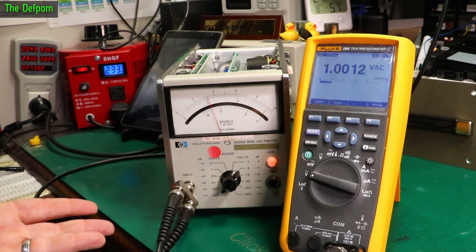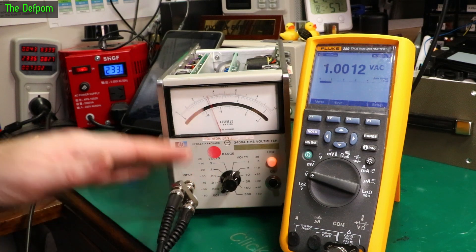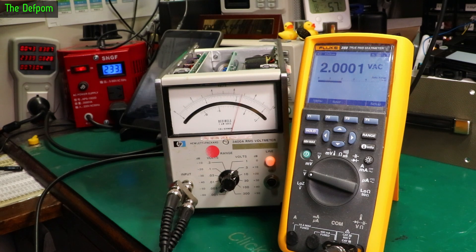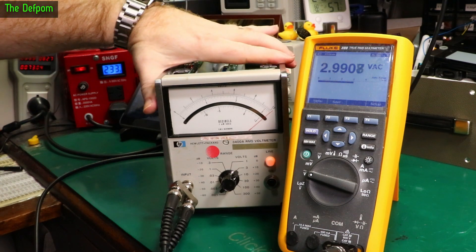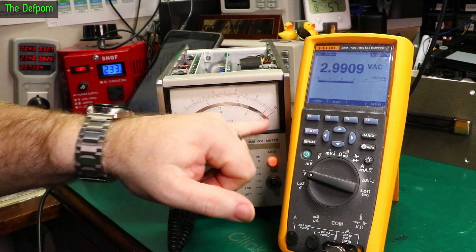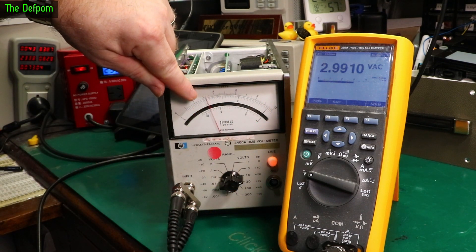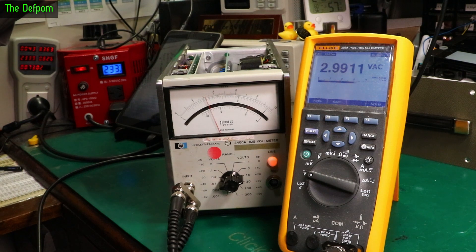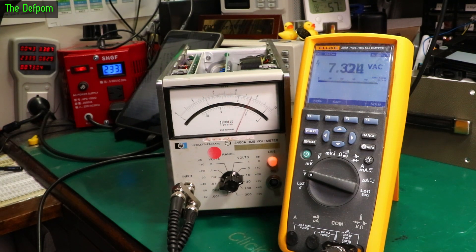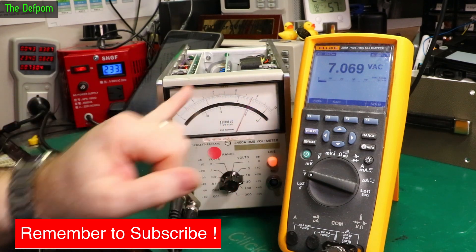This does need calibrating. I'm honestly surprised it needs calibrating, since it came from Babcock's, but it's working - so that's the best bit. Let's try some lower levels and some higher levels to see what we're getting for accuracy. I've got that set now to 2 volts RMS - we're getting more than 2 volts. At 3 volts RMS, getting very slightly below. On the 10 volt range with 3 volts, you should be over here on that mark right there, and we are sitting slightly higher. Going up to 5 volts - yeah, it's over half scale. The highest I can go on this generator is 7 volts, and you can see it's over-reading. The maximum full scale on this is wrong.